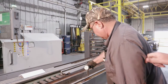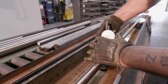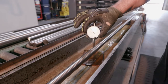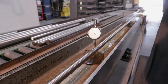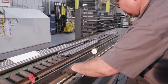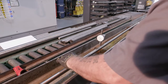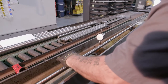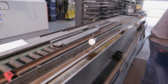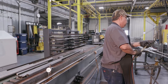What he's doing now is using a dial indicator and he's going to place it on the top of the shaft. You want to make sure that you have travel both directions on the indicator before starting the procedure. As he's rolling the shaft, you can see that there's a good amount of runout in this shaft, and what he's doing is locating it to the high spot. As the shaft has a bend in it and rolls around, we want the high spot on the top of the shaft.